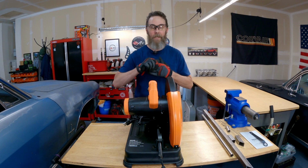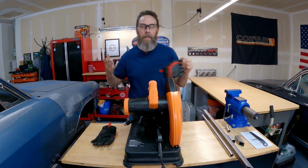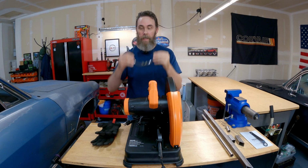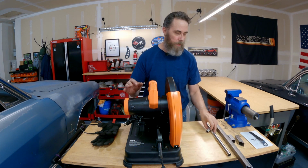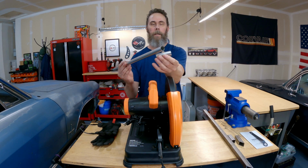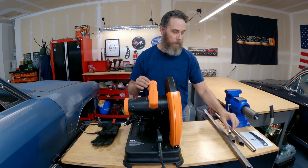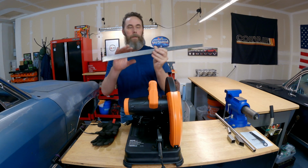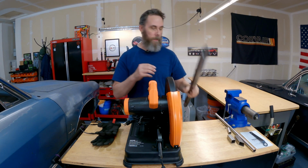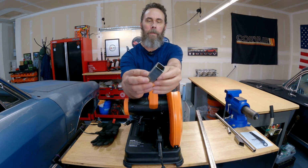Okay guys, so that was actually a lot of fun. I was actually able to make stuff that I probably would never have been able to make otherwise without this really cool tool. So as you guys saw, I was able to cut some aluminum cylindrical stock, did a 90 degree cut on it, and that seemed to work out just fine. And then I stepped up to a 1-inch tube steel that it also went through like butter and had no problems at all. I made a straight cut on it, and that seemed to work out okay.